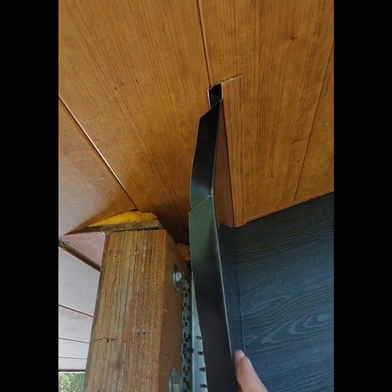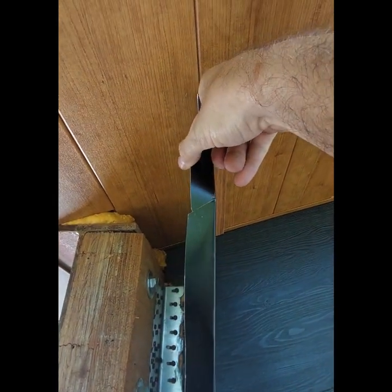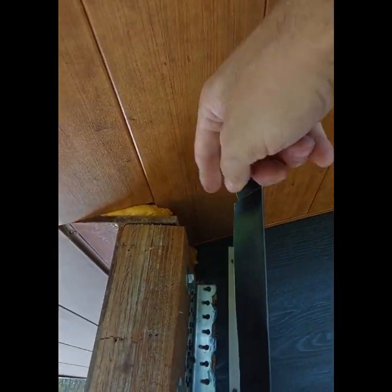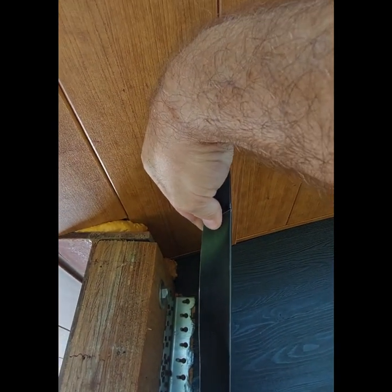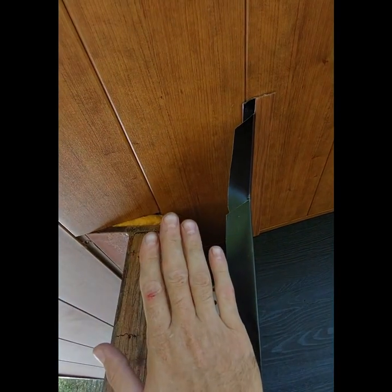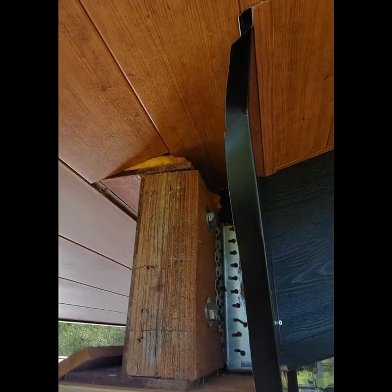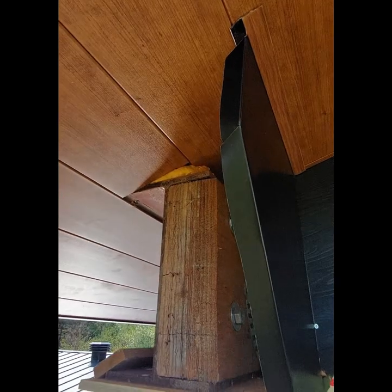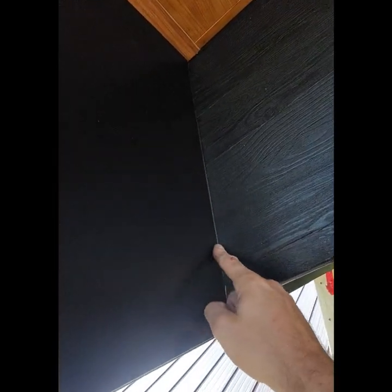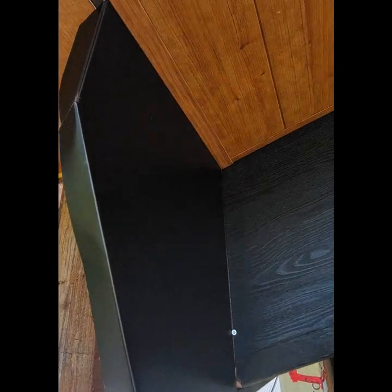You'll see here I have a little bit of a kink, and I don't have any black soffit screws with me, but I'll put it back straight and level and then put a screw in exactly where I want it to hold it perfectly straight. Then I'll have a cap going on the end with two-way tape and caulking. Once everything is dried up and the end cap is on, it'll be nice and straight. I put another screw where the caulking joint will go between the two to prevent any movement until everything is caulked in place.